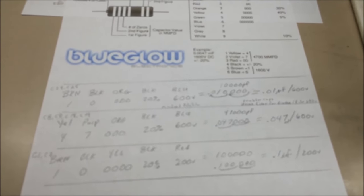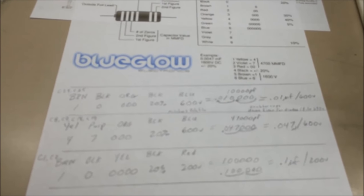These bags are much more space-efficient than the little plastic blue cabinets with drawers. For C1 and C2 — 0.1 microfarad at 200 volts — I didn't have any 200-volt ones, but I do have 630-volt ones. You can always go higher with the voltage rating; the only downside is the component gets physically bigger, which can create space limitations. But it doesn't hurt to have a higher voltage rating. Now you know what I'm going to put inside this thing — I'm going to get busy doing the soldering.